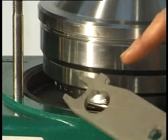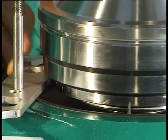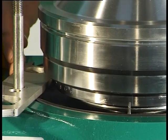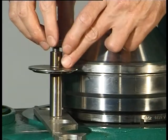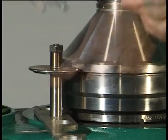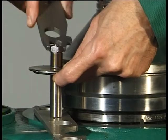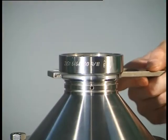Arrest the bottom with the hook wrench and hexagon nut. To do this, place the hook wrench over a stud of the lower section of the frame and let it register in a groove of the bottom. Place the holder on the stand and screw the hexagon nut on firmly. Unscrew the threaded ring — left-hand thread.